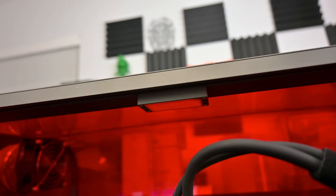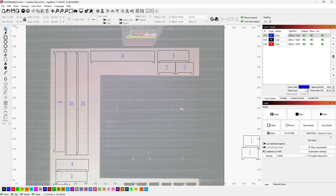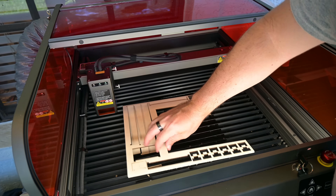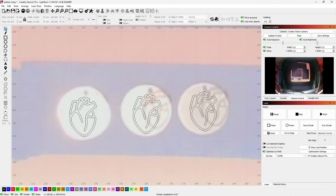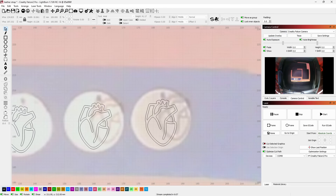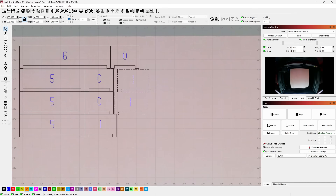At the top of the enclosure is a camera that integrates directly with LightBurn. After calibration, the camera allows you to overlay a snapshot from the camera onto the workspace, letting you position designs with ease. I was able to minimize material waste by tightly nesting designs onto existing scrap pieces just by moving designs onto the snapshot. However, I did have some issues precisely positioning pieces for very small jewelry — the design was off by a millimeter or two — though this may be user error since it was my first time using LightBurn's camera features. Overall, I love the workflow with the camera; it's far easier than trying to manually align the laser nozzle.